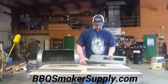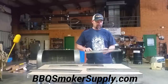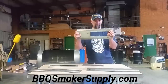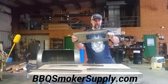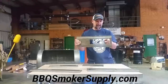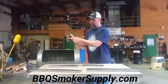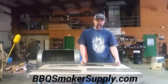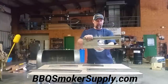To install this damper assembly, pull the slide out of the guide and push the bracket right up against the side of the firebox and trace the opening. If you've got a plasma cutter with a drag guide you can put it right in the opening and follow the line all the way around, or take it off and use a straight edge to guide it and cut it out that way. Once you're done, flip it back over and stick it right on the side.